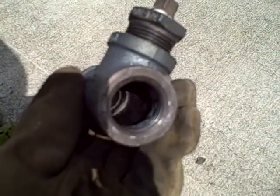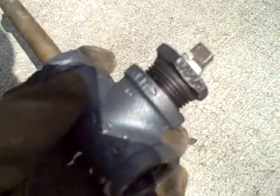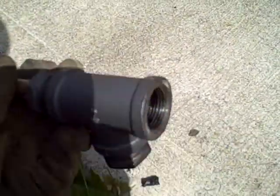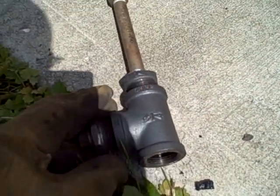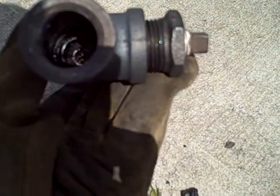So it looks like we were beginning to plug up this section pretty badly with tars. If we were to build up our own retort system, this would definitely be a problem. I can see where those tars are so thick they begin to plug up the pipework, and remember this is only about an hour's worth of run time, so building a retort system to capture all the tars and gases may be problematic. We'd have to look at some way to do things differently.